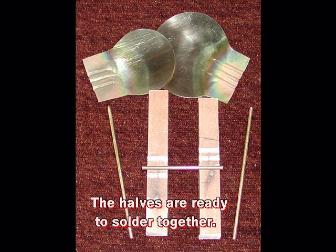When you come to solder the pieces together, a close fit is best so a minimum amount of solder is used. Shaping for the tubes will usually add some curve at right angles to the original curve, so that the two pieces are a bit dish-shaped. This is good and what is wanted. You should now have two pieces that look about like this.